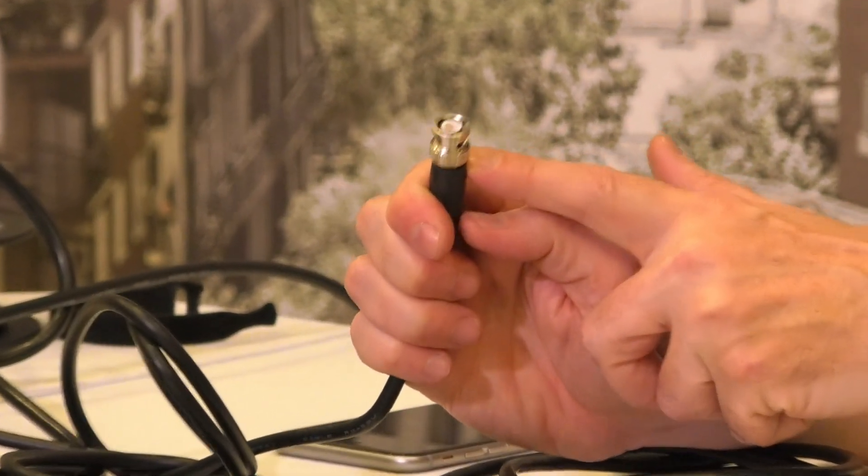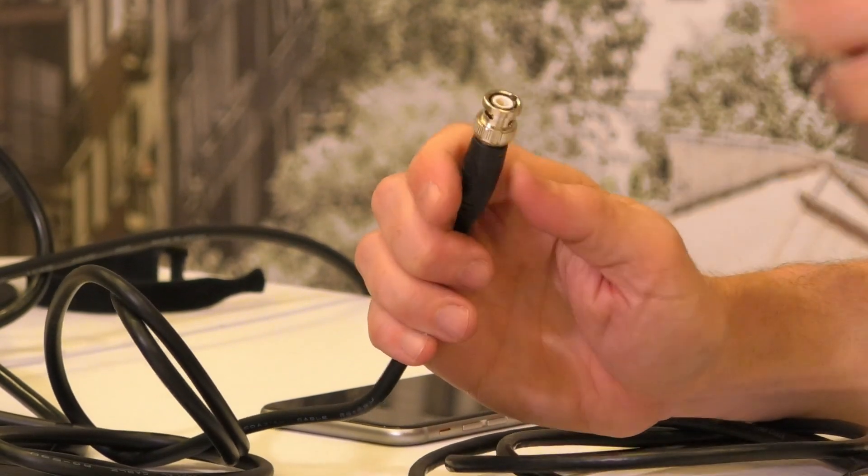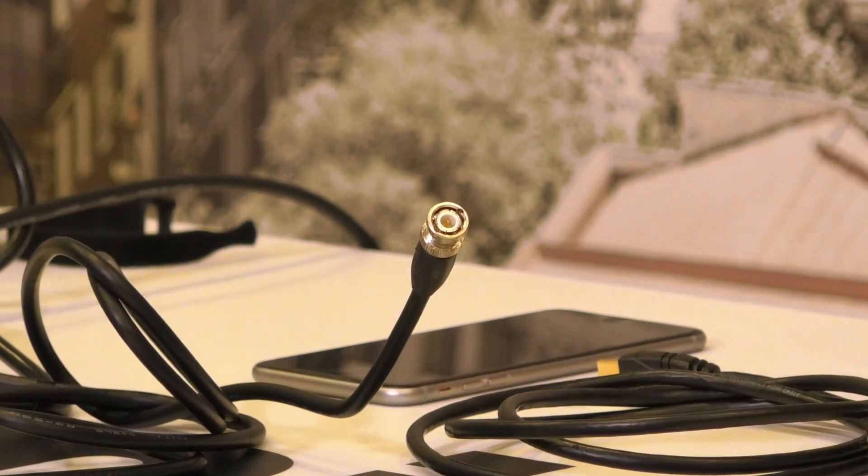We really like these because HDMI cables are finicky — we don't like to run long ones if we can avoid it. HDMI cables can't even be run that long; about 20 to 30 meters with a powered HDMI is about all you're going to get. These SDI cables? 100 meters, not a problem. They have tough-as-nails BNC connectors, they're simple two-conductor RG-59 style coax, very affordable, and they have strain relief — they don't inadvertently come unplugged if somebody yanks on them.